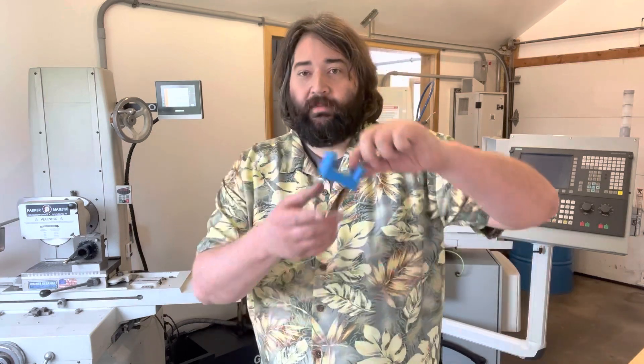I've had wire EDM v-blocks, and so there's a lot of ways to make them, but at the end of it they're all kind of expensive. One of the things you discover is that v-blocks, while very universal looking, tend to be built for specific ranges of parts. If you get on eBay and look for machinist or toolmaker's v-blocks, you see all kinds of wacky contraptions. For small runs for inspection purposes, I've been using 3D printing for v-blocks lately and it's really freed up a lot of time and energy on my part, and I thought I'd share it with you.